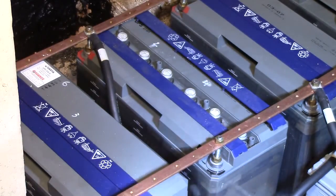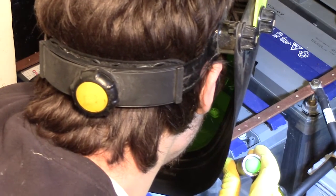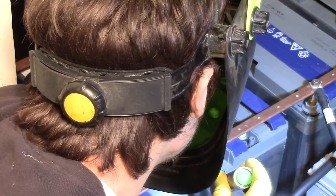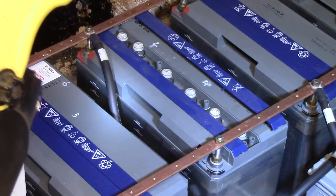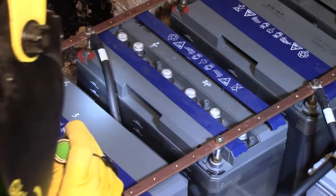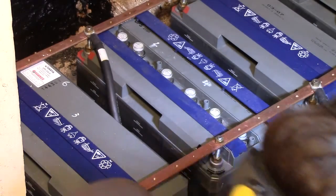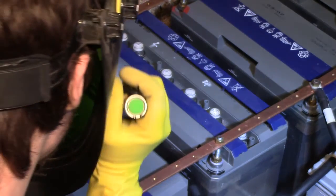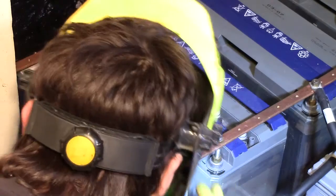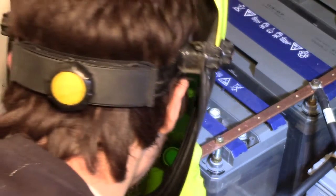I should note now that most of the extra electrolyte has been drained, but in a situation like this, handling the emergency safely is a far, far higher priority than saving the battery. There was almost an entire min-max span of electrolyte at the surface of that battery. The previously low cell is now full to the maximum marker. So now I need to reallocate the remaining electrolyte to a different cell.